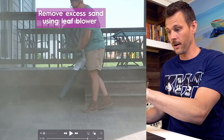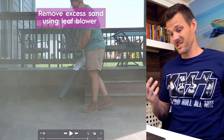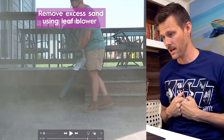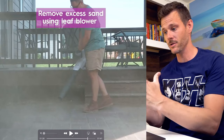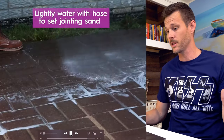See how he's blowing everything off? It's because polymeric sand is really sticky. And if you just got the hose out and you sprayed it, the polymers are going to crystallize and that's how everything locks together and hardens — it's going to stick all over the pavers. So you want to get the pavers nice and clean and gently blow off the excess like he's doing. He's doing that properly.